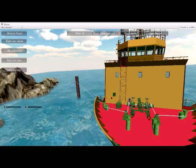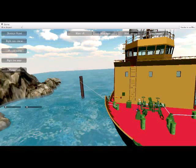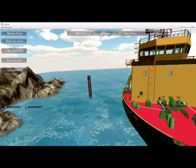Can you predict what will happen to our friend? The lines will be susceptible to breakage when the capstan is being tightened, or when a ship is passing by that could move your ship enough to strain the lines. Also, high winds can put tremendous forces on the mooring lines.